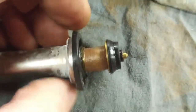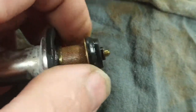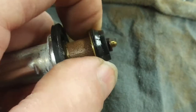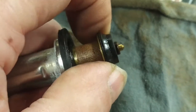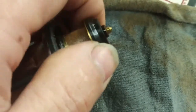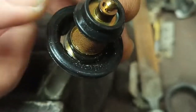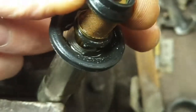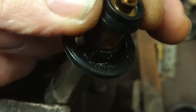There is actually a small screen in here and it's somewhat clogged. There is another portion of this valve — maybe it's the center portion that moves up and down, because the other part can't move inside the housing. It seems to be spring loaded. On further investigation, you can see there's a diaphragm in here that's actually split and ripped open. That diaphragm on the bottom is torn, so we need a new one of these valves.